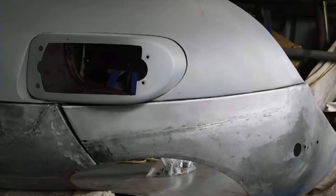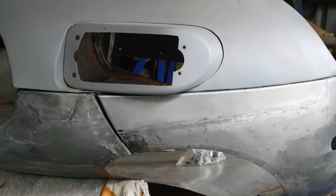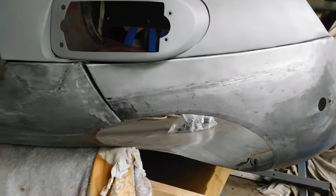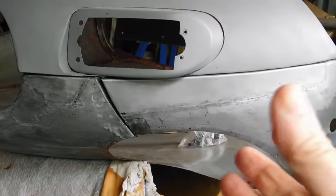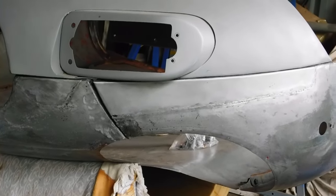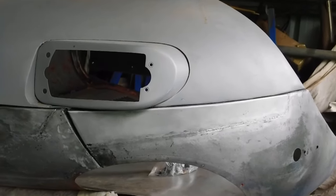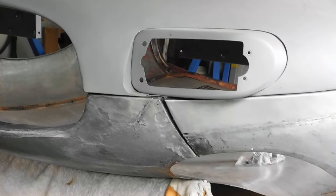Because of the large repair section, all of the holes along the top — basically from the mouth all the way around on both sides — have to be drilled. Before they're drilled, everything needs to be fitted together properly. The bottom pan is just sitting on there at the moment, so I've got a fair degree of flex to move and align the panels. That's going to take a while just to get right. I want to make sure it's even on both sides. I'm pretty sure the rear end of this bottom panel is not going to line up with the guard, but the main thing will be to get the mouth aligned and work from there.